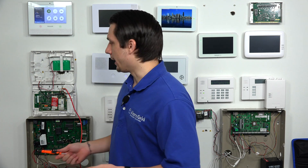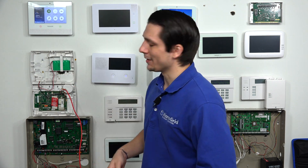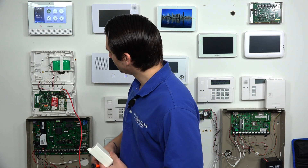Once you have that set up, normally in most instances you would have the cable fed through the wall. I just did this as a demonstration. But whenever you have that power cable set up, you're going to plug in the battery backup first, and then plug in the transformer — and that will supply power to your L7000 with the custom wire. Now that you know how to run power to the L7000 using custom wire, we're going to move over to the LT cable.